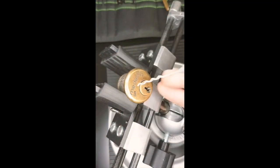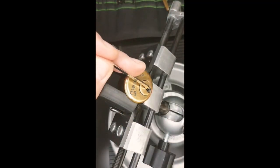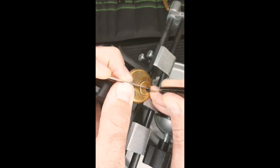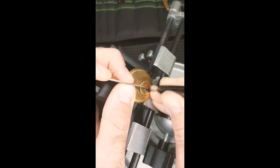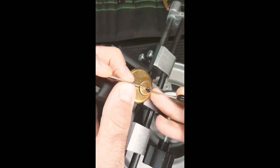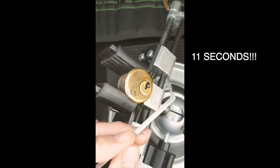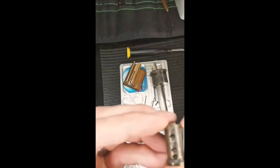Hi, this is D-Mac, and today I'm going to speed pick this Medeco rim cylinder. I just give the pins a quick rake there to mix them up, because I need to twist these around to set the sidebar and then lift them up to get to the shear line in order to get the plug open. I've got this one today in record time — I think I made it 11 seconds. I have picked this one before in more detail on the channel; I'll leave a link to that video in the description.